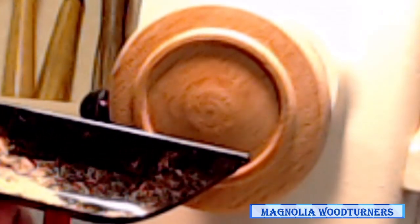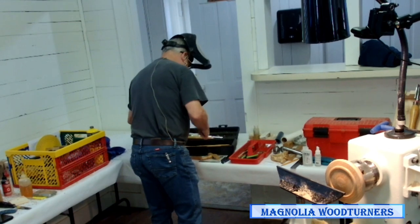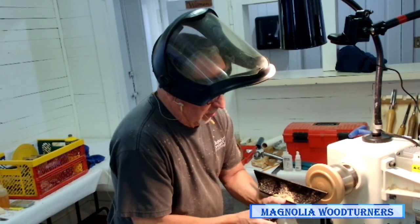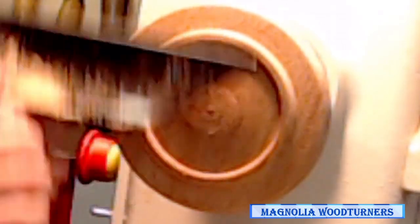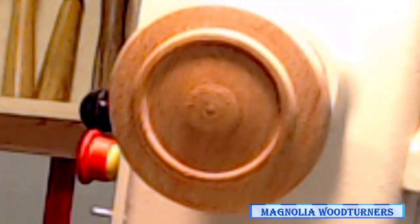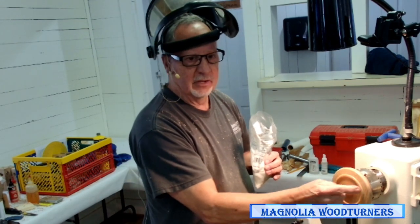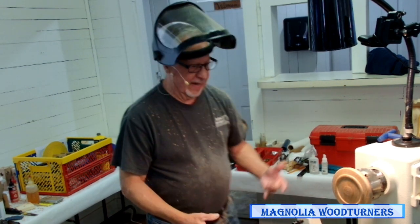What I do is go in and put a little texture like that, then go back and use whatever tool you've got handy — a lot of people use three-wing gouges, I use the toe of my skew — to kind of highlight the edges and show off the detail better. I'll hit those really lightly with 600 grit just to knock the fuzzies off. And when I put finish on I use gun patches — easier than cutting up a t-shirt, and paper towels get caught in all the little fibers from the texturing tools.